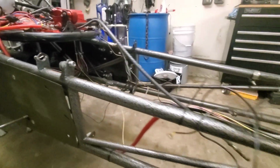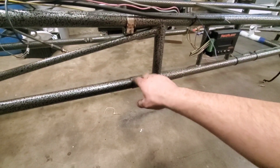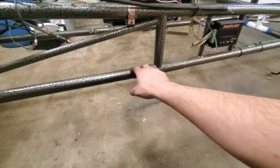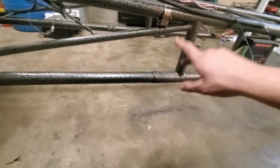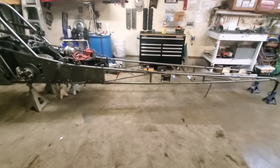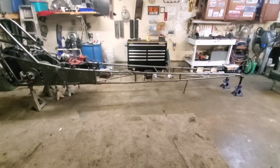So we're putting engine limiters in there and a couple other things here, but another concern that we have is these slip joints right here. A lot of people would think you can go up right here and just wash around it and weld it and you're done, but you've got to get the chassis perfectly straight first. There's no longer any more room to flex or move after those have been welded like there was before.